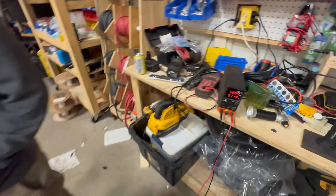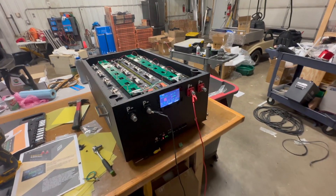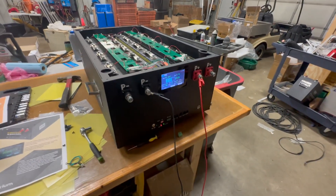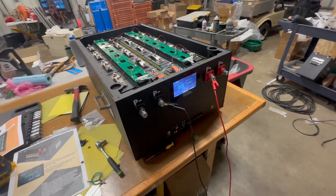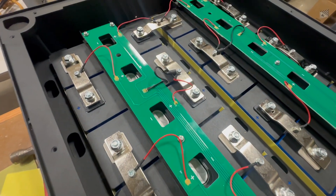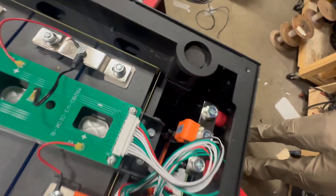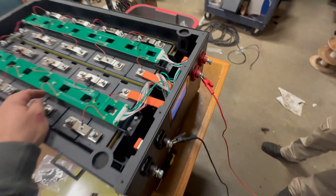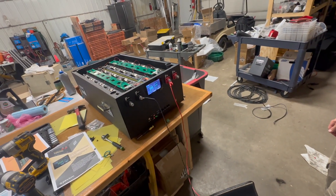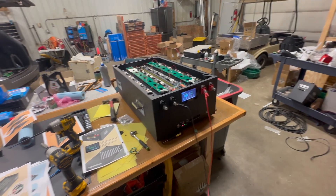Finally got it. We got it charging at five amps here. JD said this will probably take a week or two at this rate. We just wanted to test to make sure it was actually taking a charge, and it looks like it is. Here's a close-up look at all the parts in there — everything you see here is in any other battery. These are the balance leads, and all the cells are put together. What I liked is there's even an inline fuse in there. Basically, if the batteries are individually fused, you can run those in parallel as much as you want — if you've got a problem, they'll pop themselves. I think that's all I got for tonight.